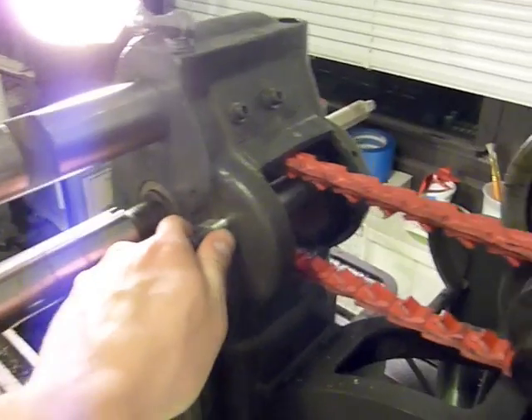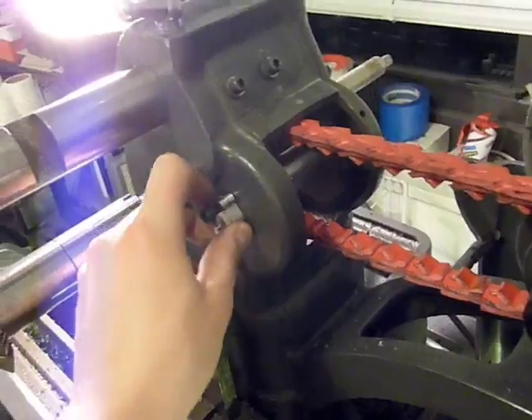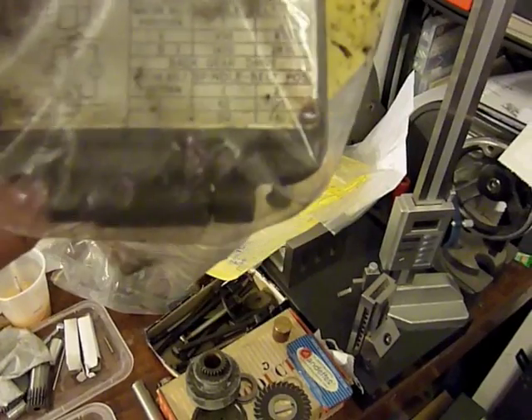I threaded this for now, just not to create any pressure, but just as a stop gap. What I wanted to show you is that my spindle belt is in position A1. According to the plate that I have removed right here, A1 in back gear should be driving at 62 RPMs.